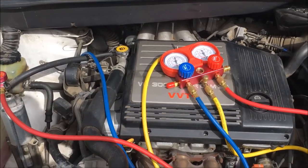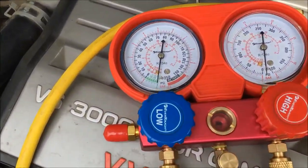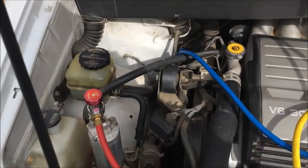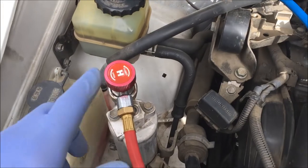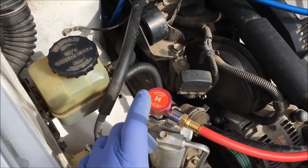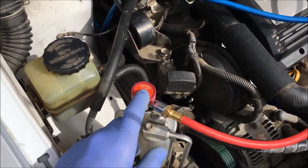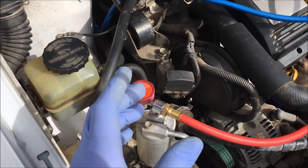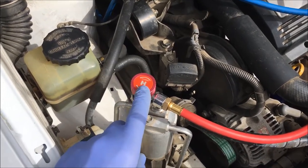It's the next morning — it did rain overnight. We came out this morning and it held. We know we have a leak because the Freon leaked out — most of it — but the vacuum on the system held. What we think our problem is is a leaking Schrader valve, and here's why: once you put the valves on the ports and vacuum the system, it's a closed system — unless you have a leak in another location other than the Schrader valves.